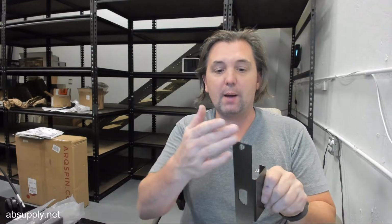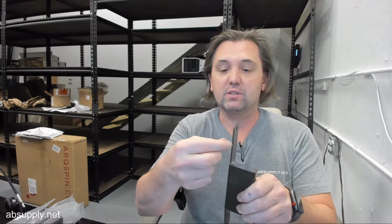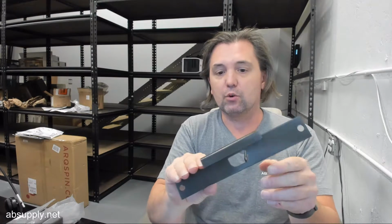So what they don't do is list the strikes that it works with, but Folger Adams would be the strike type that you'd be looking for a filler plate for. The other manufacturers could be Von Duprin, some Rofu material, but where you've got a 9-inch tall strike that is prepped and reinforced, in fact, to fit that large body into it, and you're removing it, this would be the case. We don't sell a lot of those because there's not a lot of conversions from electric strike installations to non-electrified installations, naturally.